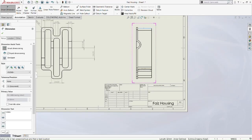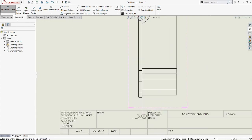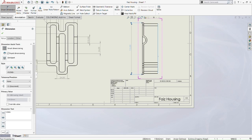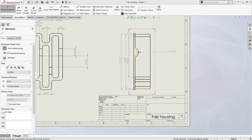Okay, let's do the overall length for the part where we did the chamfer, 119, and this one is 115. So that's a difference of 4mm from the fillet we did just now. Okay, this part here is 85mm. Okay, this radius of the curve that we did for offset just now is R10.5 radius, and this one is 29.94, almost 30mm. This one is 68.94mm.